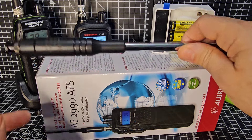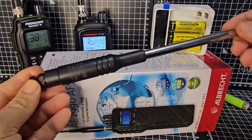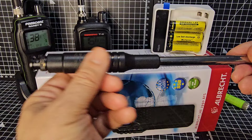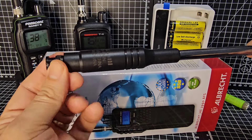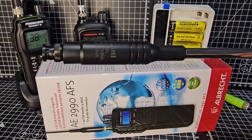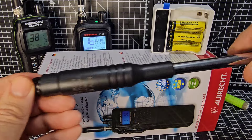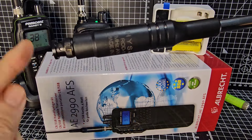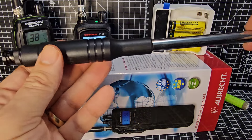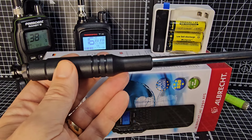Let's have a closer look. These antennas are honestly about £8 on AliExpress, or more like £15 on Amazon UK — there are chrome ones available too. Many people fit a counterpoise, clipping it to the bottom where the BNC connector is, and that's 140 centimetres long. It acts almost like a dipole, and the counterpoise is going to give you better reception and especially better transmission. You need to be careful with your SWR.